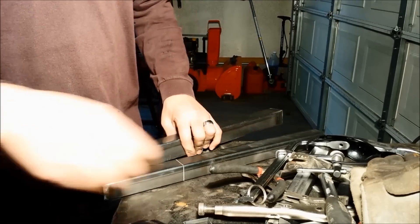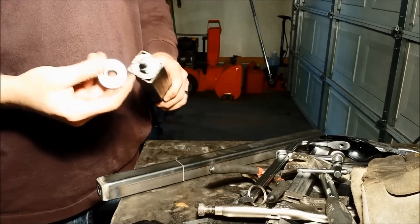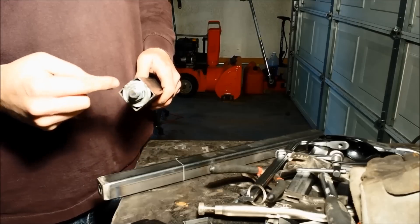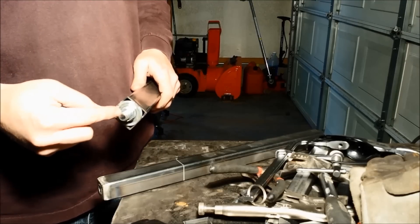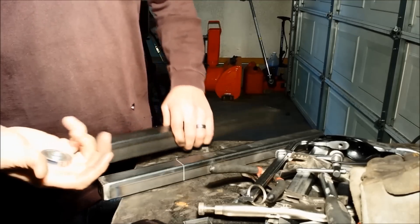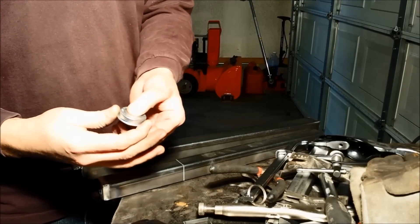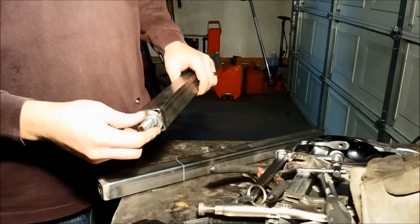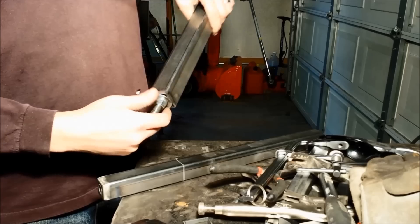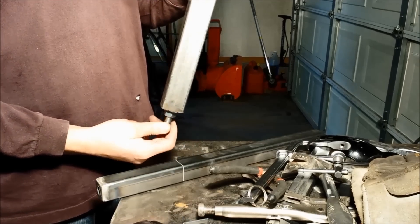This other tube — on the end I have a bearing, and it has some all-thread going through it. On either side of the bearing I have a couple of nuts. The one on the inside is actually welded to the all-thread so it won't move; the one on the outside I just tightened down against that, sandwiching against the inner race of the bearing so it can spin freely and take the weight. What I plan on doing is placing a small sprocket here — which I'll probably cut on the CNC machine — sandwich it with another nut, and then run a chain to the others so they'll all move together.